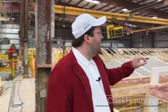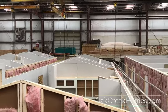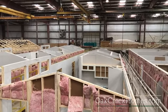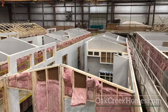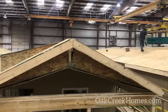You have your 8-foot sidewall, which leads into the 6/12 roof pitch. Not only that, but we're doing a big interior pitch as well, which leads to a really open feeling in the house and really opens up the room — they feel very large. After our insulation is blown in, our roof decking is attached — we use OSB roof decking.